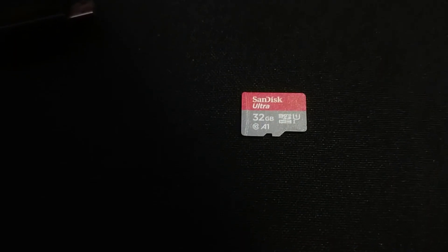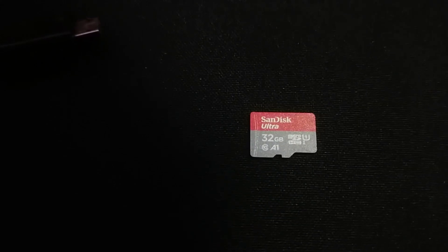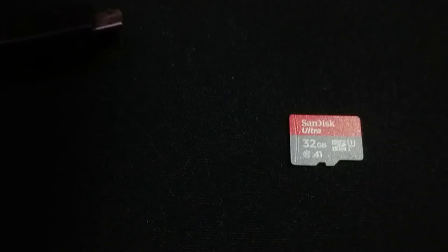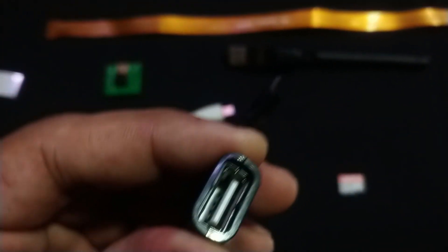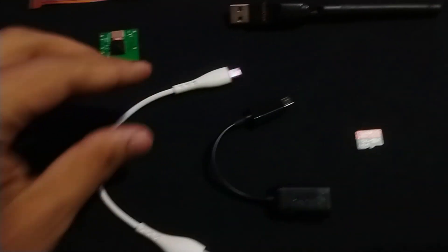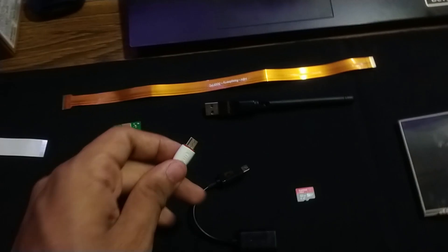After this you will need an SD card. This is a 32 GB SanDisk SD card. You can also go with any other SD card available in the market, but make sure it is at least 16 GB and above class 10 for better user experience. Also you will need an OTG cable to connect external peripherals like keyboard, mouse and Wi-Fi antennas. You will also need a micro USB cable, as the Raspberry Pi Zero uses a micro USB port — not Type-C — for power supply.